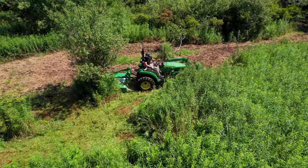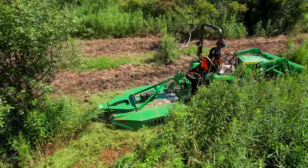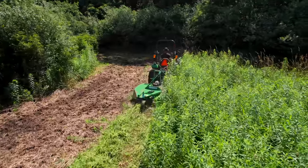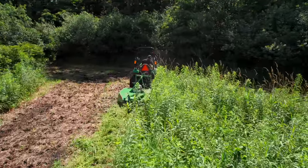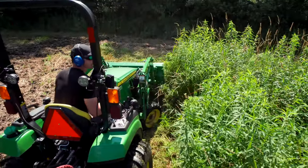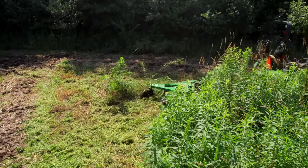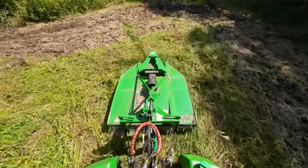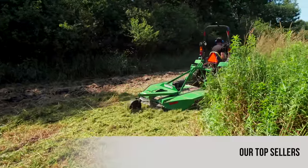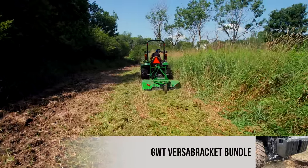One thing to avoid is cutting too low. This is not a finish mower or a flail mower — brush hogs don't excel when cutting too low. You'll get too much debris clogging up and bogging down the mower, and you'll be prone to scalping. Scalping is bad for several reasons: you'll wear your blades down much quicker, and you're far more likely to catch rocks, branches, or hidden metal debris. We shared pictures recently of a guy brush hogging who flung a hunk of steel that came flying out and whacked his UTV. If you're scalping the ground a lot, you're much more prone to that.